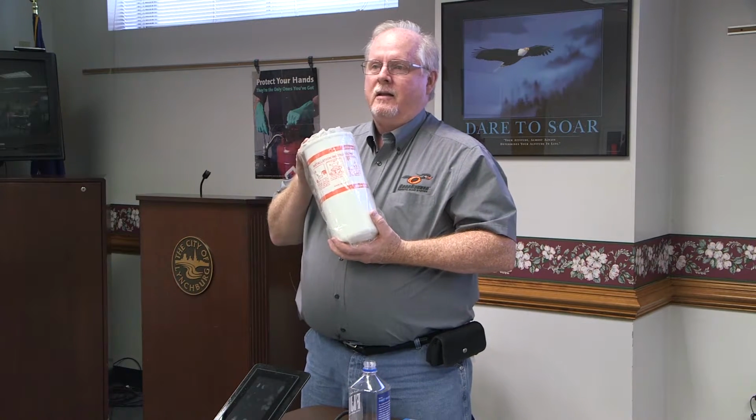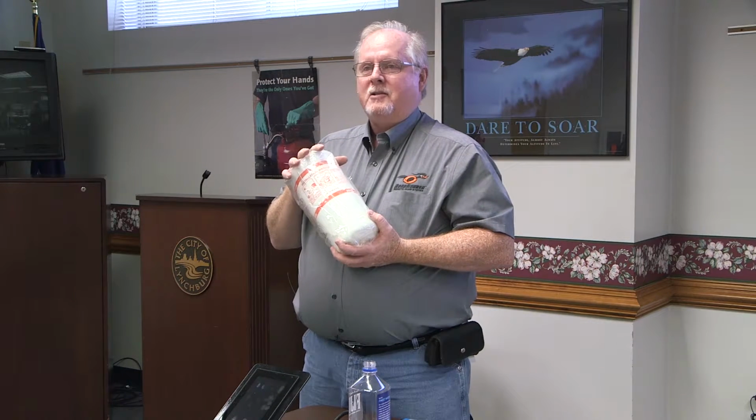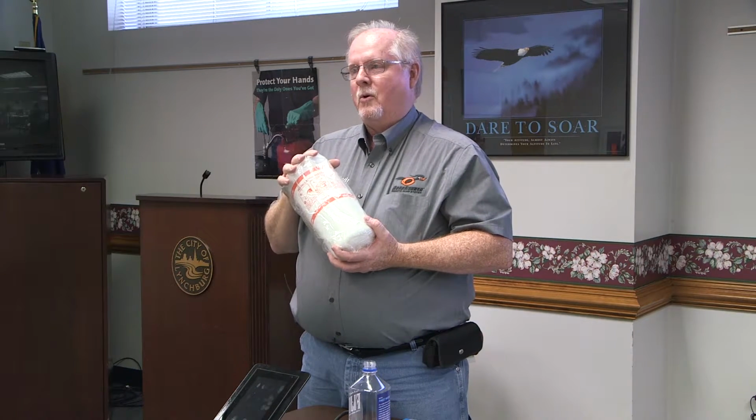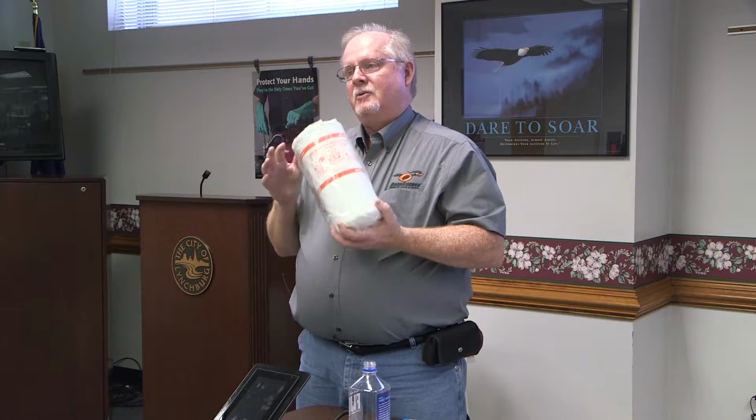Pampers, whatever name it might be. I'm not a proponent of those because my kids are grown and gone. I got grandkids now. But the same things that they put in a baby diaper are the same things that are in here, and it's meant to absorb water. It'll let the oil pass through it, but it absorbs the water in the oil as long as it's passing by slow. So that was an interesting thing that I found out years ago about these, because I've used these from time to time when we've had an issue or accidentally a customer put some dirty oil in it or whatever.